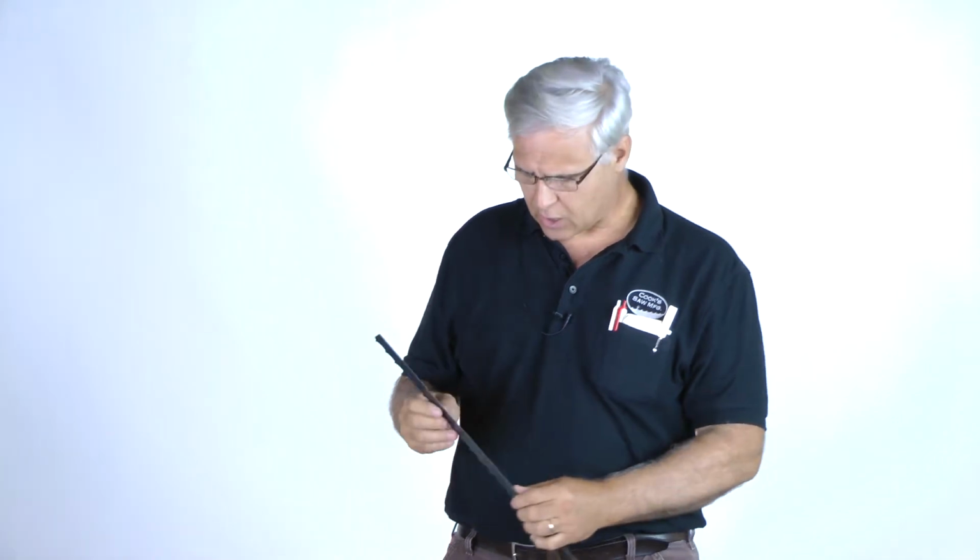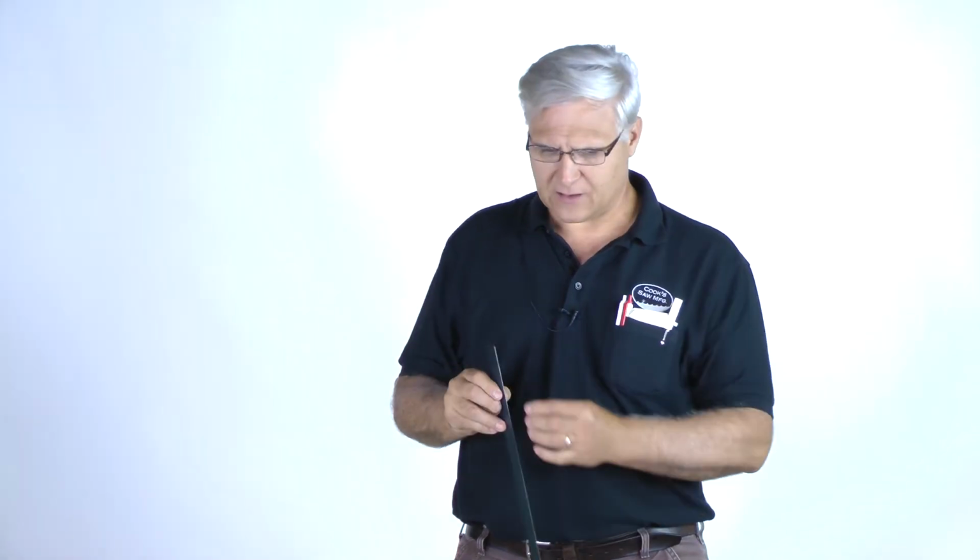If you're in a resaw situation where you're cutting thin boards, it comes into play even more. We built resaws before where a man was making fencing, and he wanted to save a 5/16 board. By the time he made several cuts, he would save a 5/16 to 3/8. I think he was coming in just under 3/8, but it was acceptable. And he saved one board per cant just because he was saving a few thousandths on each board. Sometimes that can be very critical to you, and that's why these thin kerf blades are out there.